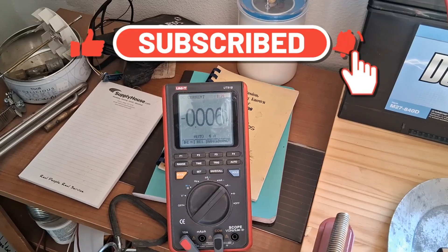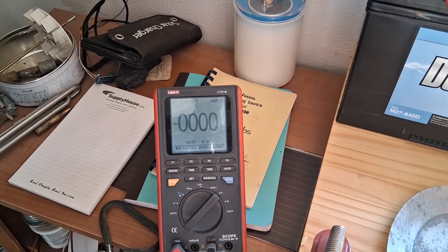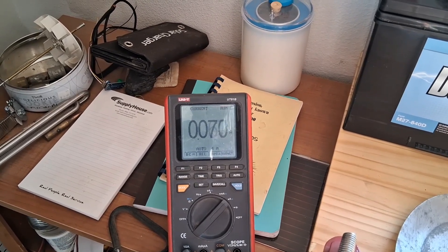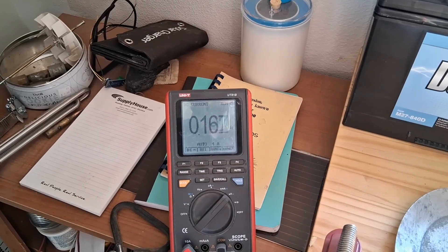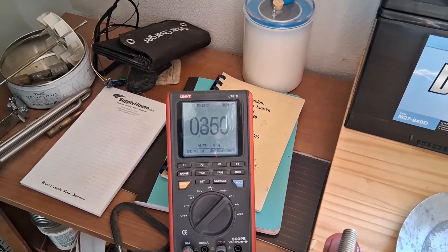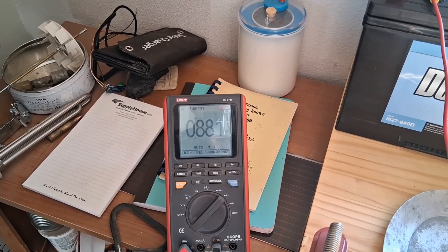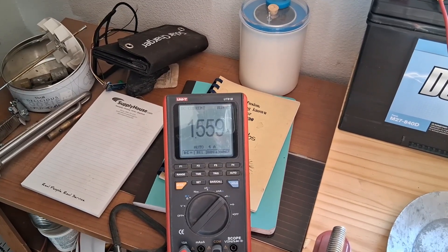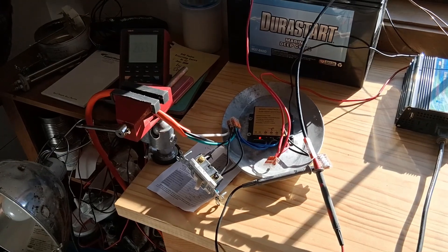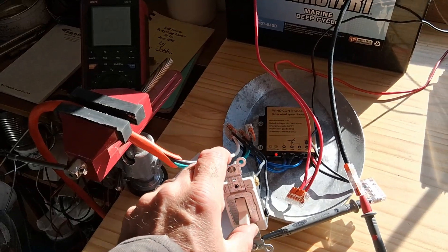I've reconnected the wind controller drawing that six milliamps again. I'll take the brake off and wait for the wind to kick in. It takes a while for the wind turbine to get up to speed. I think the wind today is anywhere from 10 to 15 miles per hour. Around one amp is about what we get at 10 miles per hour when I first tested it. So we have some charging going on — must be around 10 miles per hour or more. That's probably around 15 or a little better. The battery is charged up and starting to unload, so I'm going to switch off and put the brake on again.